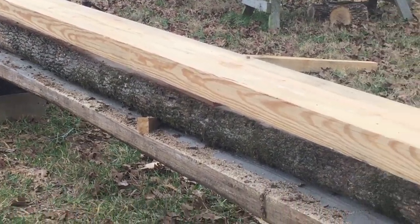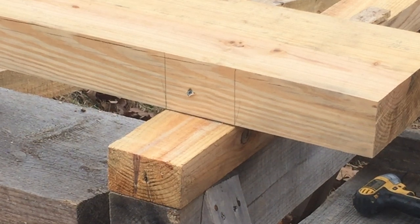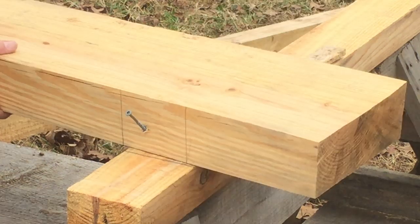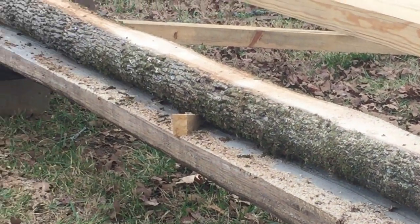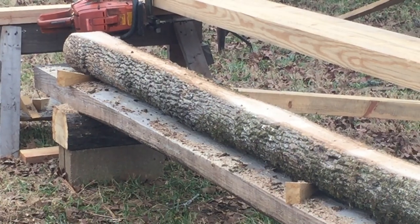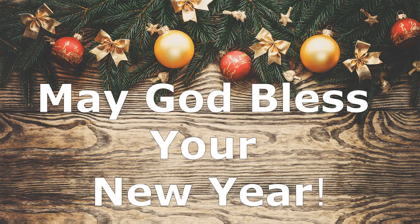I went the full length of this joist. I'll come back and remove the screws in the timber that help hold it steady and keep it from sliding around — though it's pretty heavy, I do that just to keep it in the leveled-up spot. There you have it, flattened on top. It's an easy thing to do and it can save some hewing. If you want to hew yours, that's fine — I encourage you to do so because hewing is enjoyable and will give you experience with a broadaxe that you can use when you get onto the wall logs. I appreciate you watching, and we hope you had a very merry Christmas. May God bless you and yours through the new year.